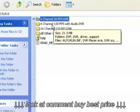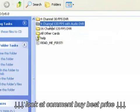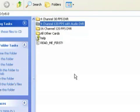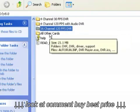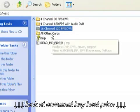There is a 4-channel 120 frame per second card with audio. If you have that one, you open up the second folder, which says 4-channel 120 FPS with audio. And lastly, there's another card, a 16-channel 120. It's a 16-channel card that does 7.5 frames per second per channel. And if you have that card, you open up this folder. Most customers are going to have to open up the folder called All Other Cards.